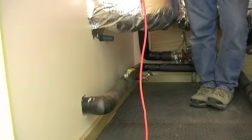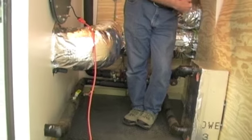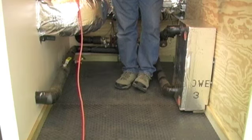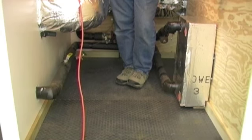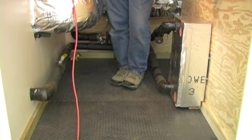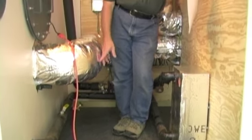If you put a hose in a tank and walk away for a few hours, you'll overflow the bucket, it'll overflow on the floor, and you'll have a lot of damage in here. We're going to put a hose on here so that it easily goes into a bucket, but when you fill this tank, you want to make sure that you do not overflow much into that bucket before you turn the water off. The other thing is, during your first firing, the water's going to expand in the tank, it's going to overflow in the bucket.